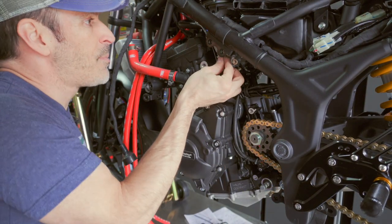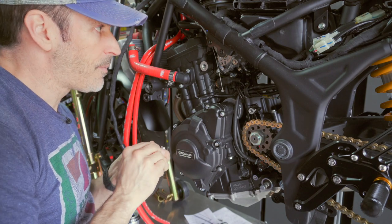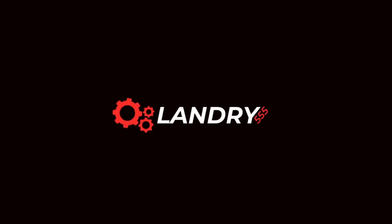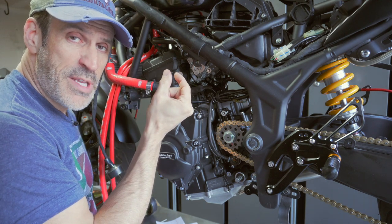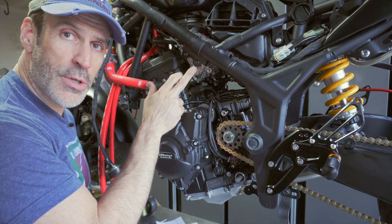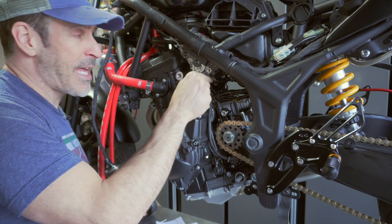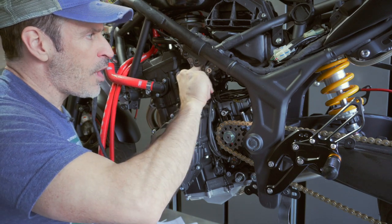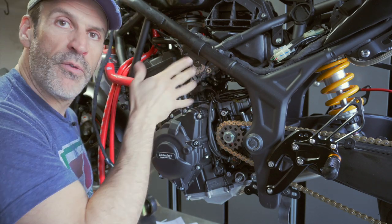Now that this is in place I'm simply going to put the lock washer and screw that nut back in place. Just to recap: when you reinstall the new spring you'll have your spring, the plastic spacer, the cam, your split washer or lock washer, and then your nut on top. Make sure the cam is going back to its original location when you flip it, that it can go all the way, and that the spring won't bind or get stuck anywhere and that everything is moving properly. It's critical before you reassemble everything that you check and make sure this is working flawlessly.